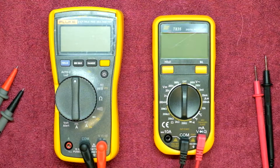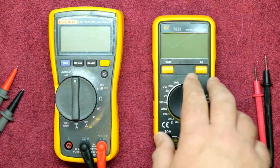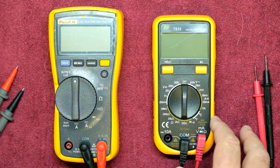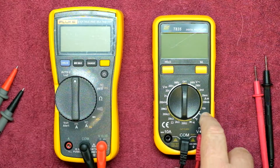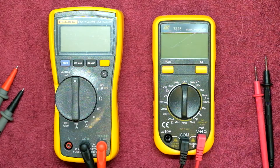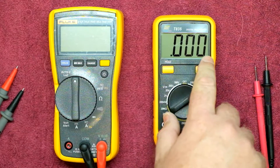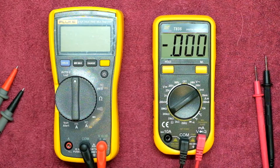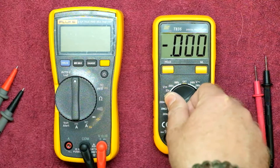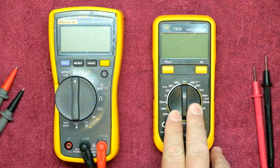We're going to take out our few little test components. This meter does volts AC and DC, up to 20 mega ohms of resistance, diode continuity, degrees Fahrenheit and Celsius, up to 10 amps, and as low as 2 milliamps on the range — giving a range down to actual microamps. For all intents and purposes it might be able to do the job quite nicely.